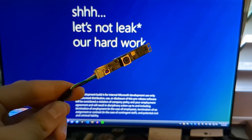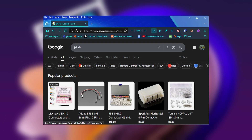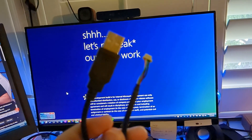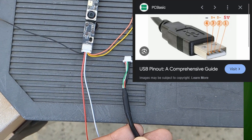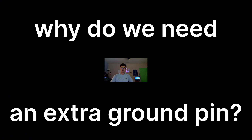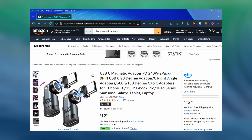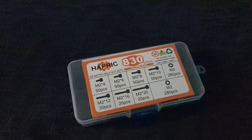One of the reasons I bought this camera is because the cable detaches with a little JST connector. After some research, I determined it's a JST-SH connector and ordered cables to match. This will greatly simplify assembly and means I don't have to sacrifice the original USB cable. USB uses four pins for power and data, but this camera has five pins — the mysterious bonus pin is just tied to ground, so we'll solder both ground wires to ground on the USB-C port. Finally, I ordered magnetic USB-C connectors, which should allow the camera to swivel, as well as an M2 screw set to attach everything together.